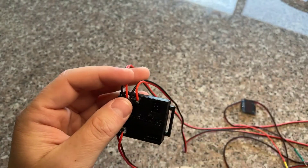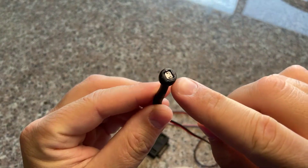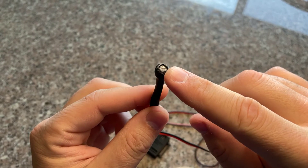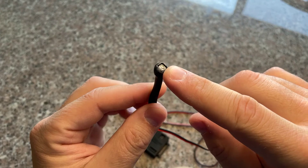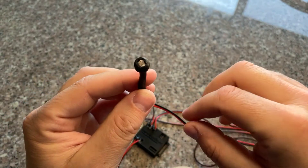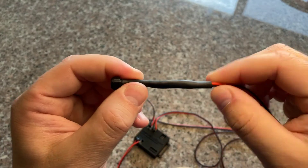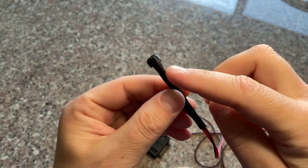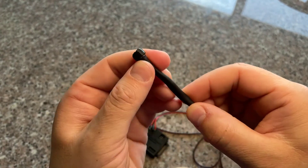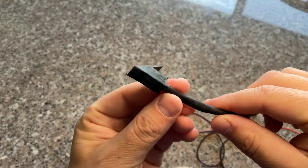The other wires are the LED and the photo sensor. The photo sensor goes up on your dash and reads the light output — day or night — doing a live reading of the amount of sunlight or daylight, which then tells the code on the box to either turn the LED on or off. It's shrink wrapped and flexible, and it hides up on the dash really well.